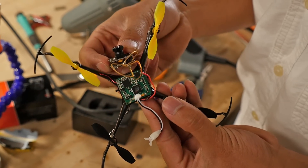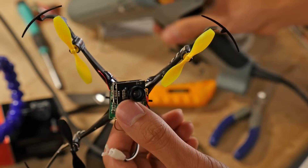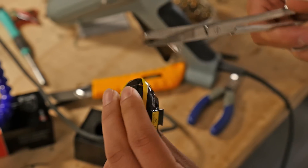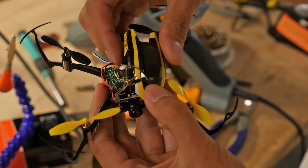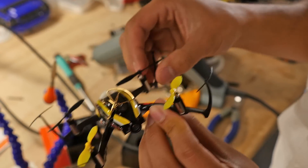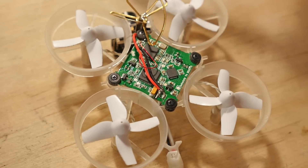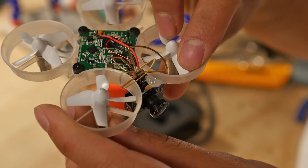Once the soldering is done, close it back up and plug the battery leads back in. We're also going to glue the camera on using a little hot glue, in case you want to remove the camera later — a few quick drops of denatured alcohol around the hot glue will easily release it so you can move the camera without destroying it. Then fit the canopy back on, clip to the side, slide it back in, and you're pretty much done. For the Inductrix, the procedure is pretty much the same — actually a little easier because the solder pads are on the other side, so you just take the cover off and solder there.